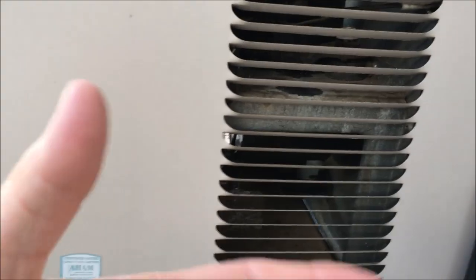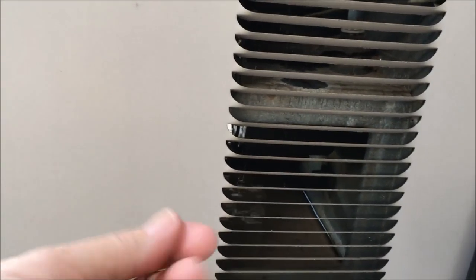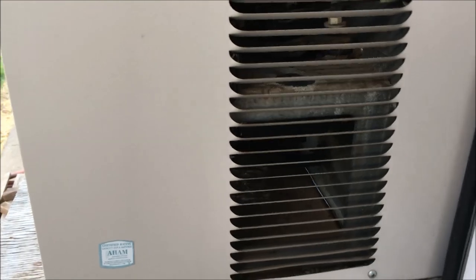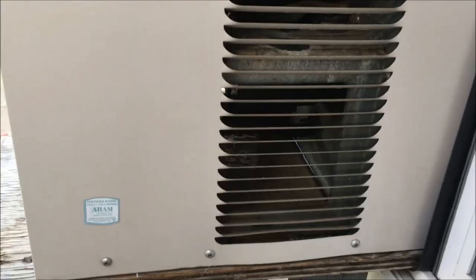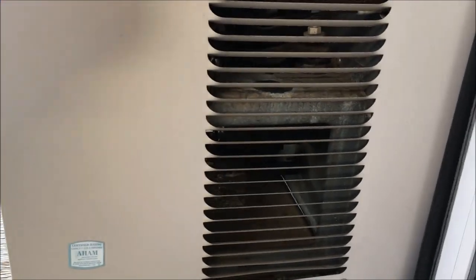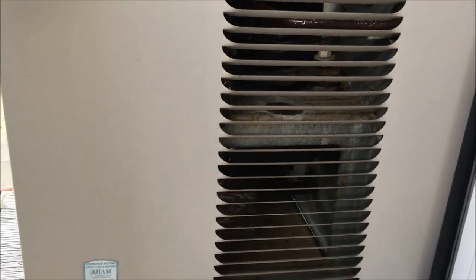The purpose of leaving the water is to allow it to be picked up by the fan and splashed onto the condenser coils. It's supposed to cool them down because the condenser coils have hot gas when they're running. So it's supposed to improve the efficiency and make the AC work less hard.